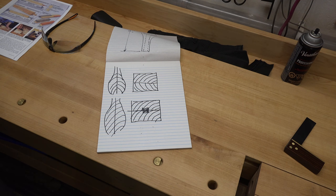The lower half of the pedestal is glued up and there's nothing more we can do other than wait for the glue to dry. In the meantime we're going to start drawing out the template for our legs, for which we'll need a piece of one-eighth-inch hardboard. We're going to start marking out our legs — I'm leaving one edge that is three-eighths of an inch wide, which will be our dovetail going into the main pedestal base.